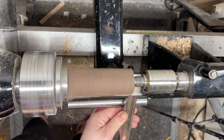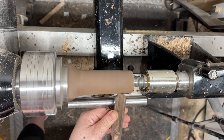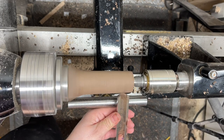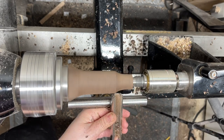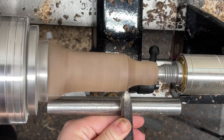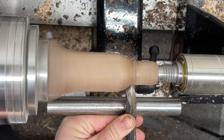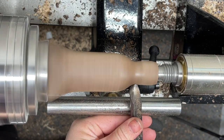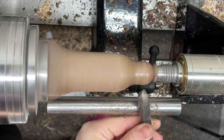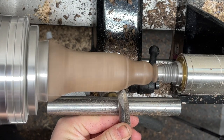Start turning down those corners. I'm using a pretty cheap spindle roughing gouge just to knock the corners down. Then I'm going to start removing the material where the head is, rough turning this area before I switch over to my spindle gouge, and then doing a little bit more refined shaping of the neck and head area — I'm really just turning a cove and then into a bead, and then just refining the shape a bit more.